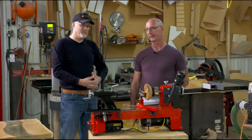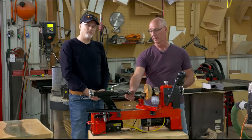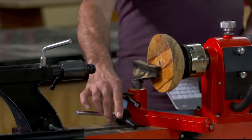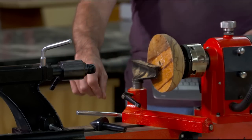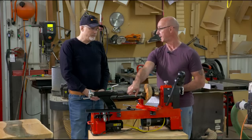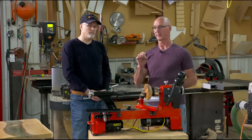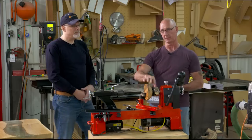The gist of this is that it's not unusual for the tailstock end to spin — what's unusual is that the tailstock itself is spinning. Normally it's a live center, but the bearings on this are here. That's a one-inch 8 TPI thread on there. Anything with a number two morse taper can go in there, and anything with a one-inch 8 TPI can go on there. It'll make more sense when we watch this video where I start here and finish here.